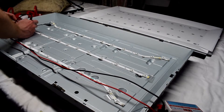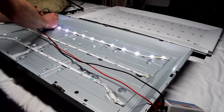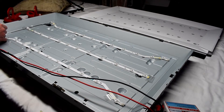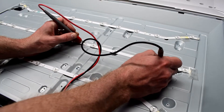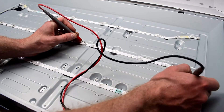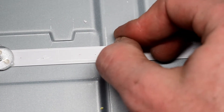Now with access to the LED strips, just use your LED tester. I put a link to the LED tester in the description. You can see the top strip is working and it measures about 35 volts. Each of these LEDs is 3 volts, and I've also put replacement LEDs in the description. The top and bottom strips were working but the middle one was not, so we have to find the blown one — it could just be one or a couple.